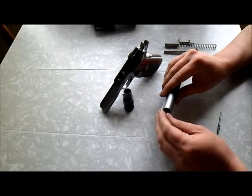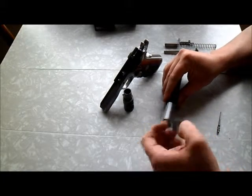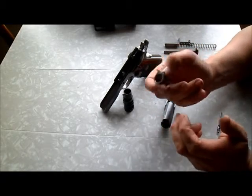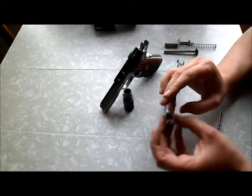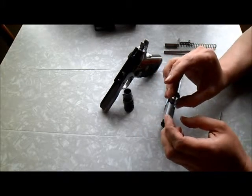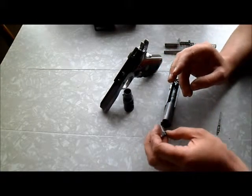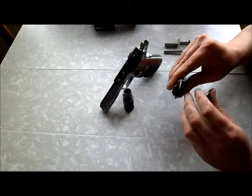It was a lot worse when I was using the Taurus barrel bushing. So if you're getting a Taurus, I suggest you just take that barrel bushing and just shit can it. And as for production, the Wilson Combat is quite good. I mean, it does the trick, but it just doesn't quite get it as tight a grouping gun as it should be. But it gets it real close, and I mean, it's not Wilson Combat's job to make it a perfect fit for a Taurus, because it would not fit a Colt or a Kimber or a Les Baer or any other manufacturer. I mean, Taurus is a little proprietary on the size of the slide.